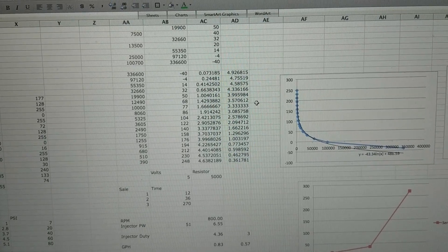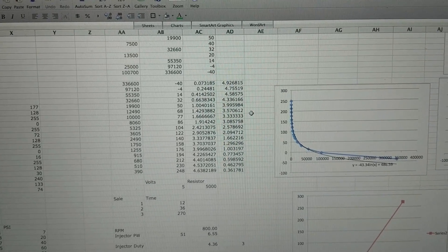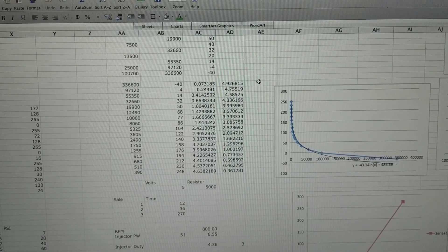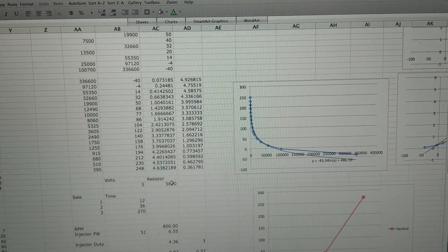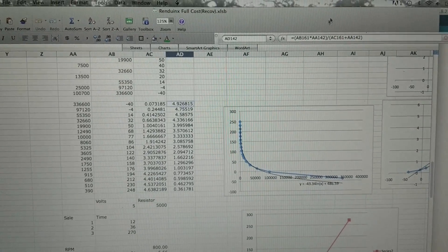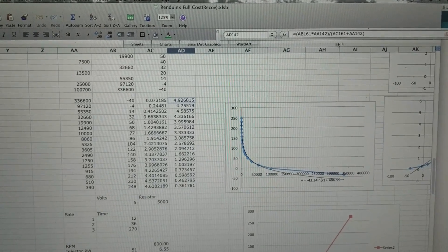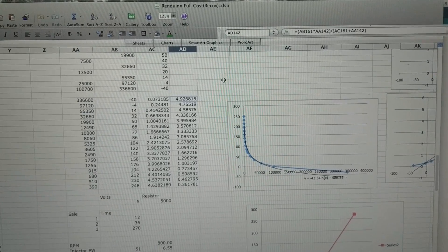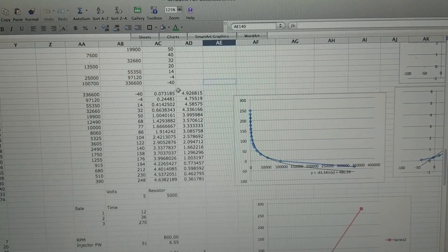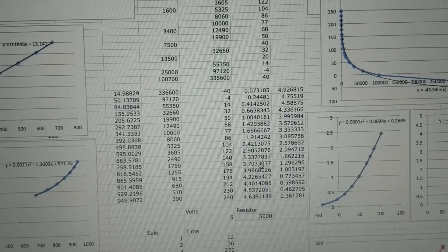In order to use this, we need to make a voltage divider, because it's hard to read resistance but it's easy to read voltage. If we add a second resistor into this sensor, we get a voltage out instead of a resistance out. If we take a 5,000 ohm resistor and add some math - the formula is voltage times R2 divided by R1 plus R2, R1 being the sensor and R2 being the resistor. We can change our resistor value to change the output voltages.